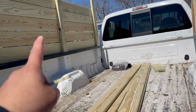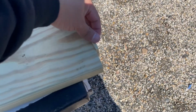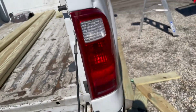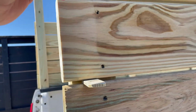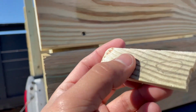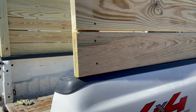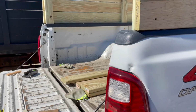And when you cut, I use this wood. The same wood, and I put the pieces on its left. I just took one of those and took some measurements here and cut it with the circular saw there. Just make sure to cut a few of these because this breaks easily. Sometimes you have to make pressure here, put it down so you can put the screws, and sometimes to remove this, it breaks easily. So like you see, I broke one here. And the other side also broke a few. So just make enough, like 5 of these pieces. Then cut it in half, just break it down.